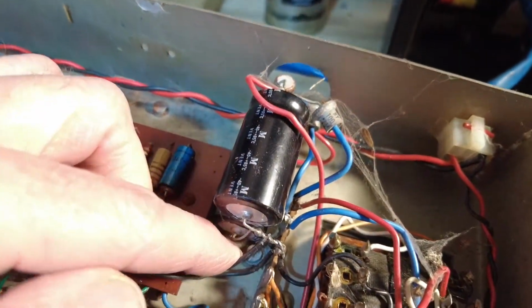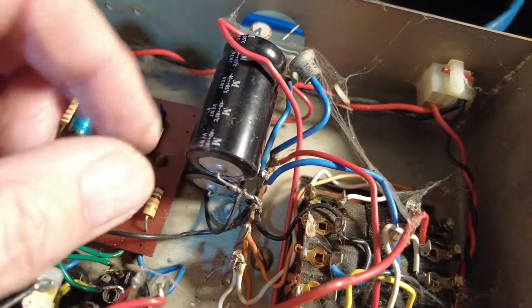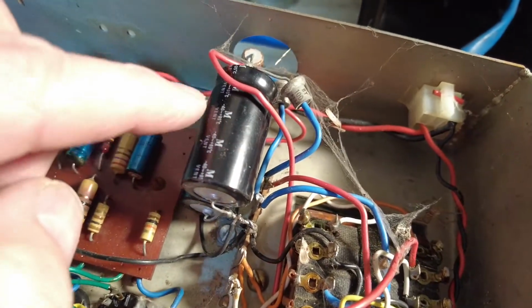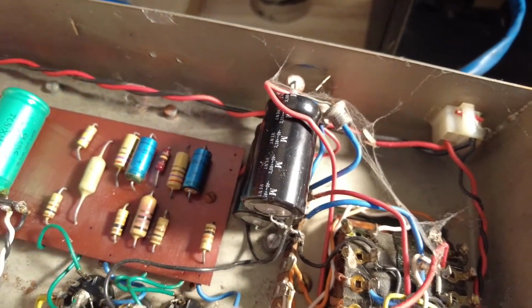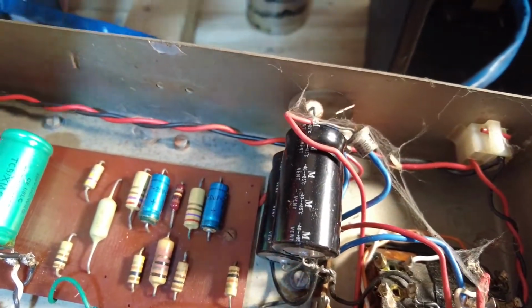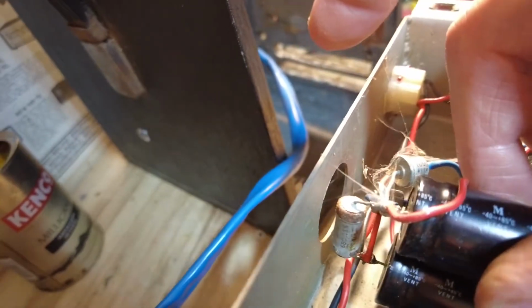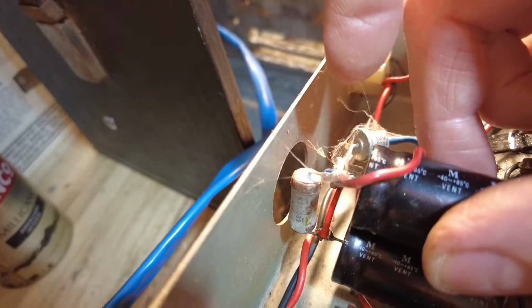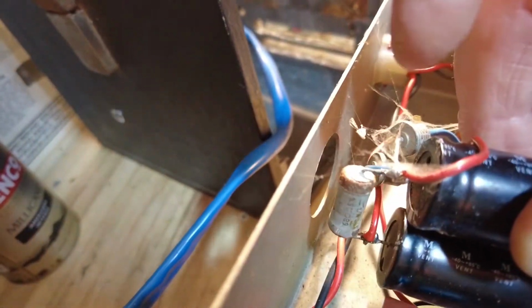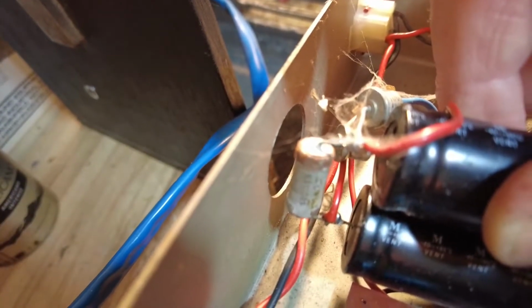Yeah, let's just check this out here. So botched on, wire just tacked across there. All this has been botched. Dearie me, why would you do that to such a beautiful amp? It just pains me. And the other thing is, on the front here there is a resistor. That's obviously a drop-in resistor across those. Now I've seen many a burnt resistor, but I've never seen one that is rusty, and you can just see all the rust. That's just actually gone rusty there.